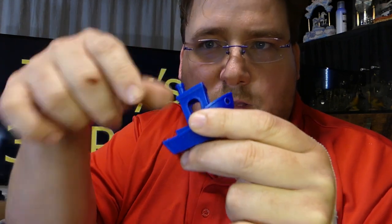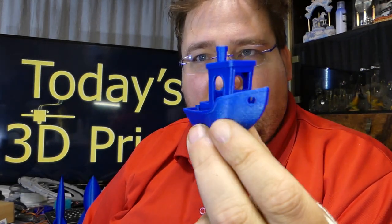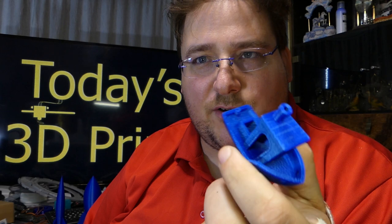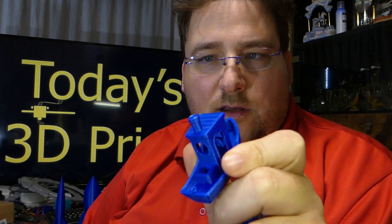This is Proto Pasta — an American company that makes the filament here in the U.S., San Francisco, I believe. Joel Telling actually went there to choose this color; he picked the amount and type of ingredients to get this color — that's why it's called High Five Blue. Subscribe to him if you're not already — great channel. Proto Pasta's HTPLA V3 High Five Blue: if you've got the cash to splurge, I don't think you'll regret it. I didn't have to do anything different except use at least 215 degrees Celsius on the hot end, and you could probably print a little hotter if you want.